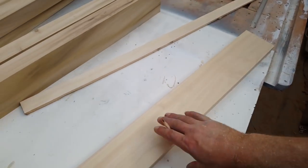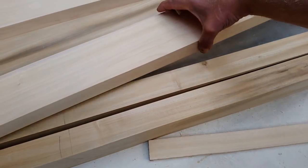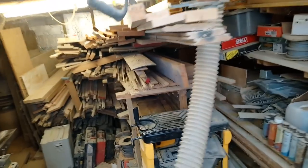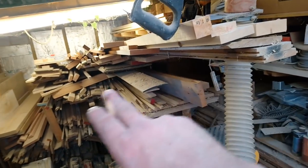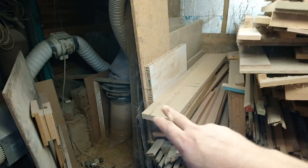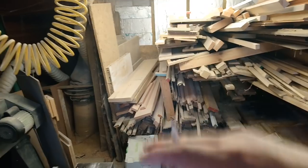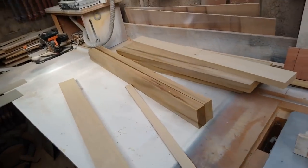Right, I just cut two pieces, this is the same length as those top rails. I've got another piece there that I'm going to use as a brace. I had to dig it out of my rack there, pack pieces up underneath to hold that bar so that I could slide that timber out. Those two pieces came out of a wide board like that. I did the same as I did on the legs, put one straight edge on, ripped it down the middle, cleaned that edge up again, and then planed them until they're square. But that now is well dodgy. Anyway, back to this.